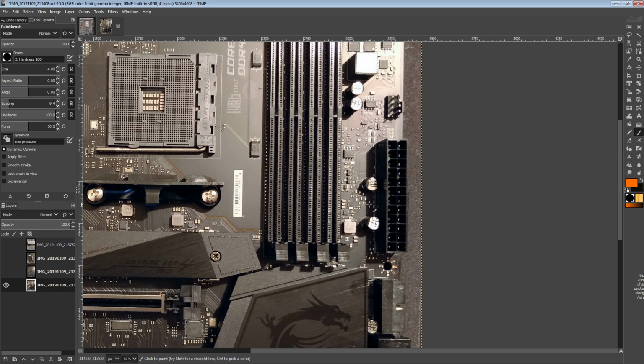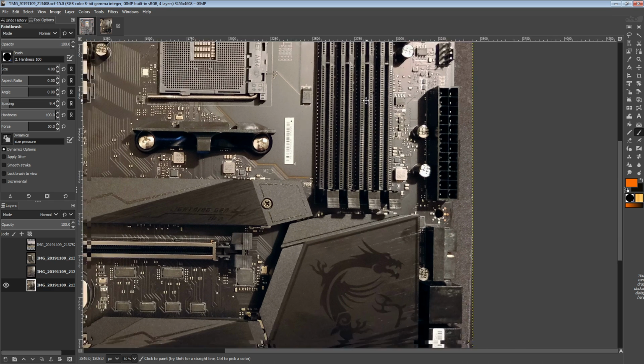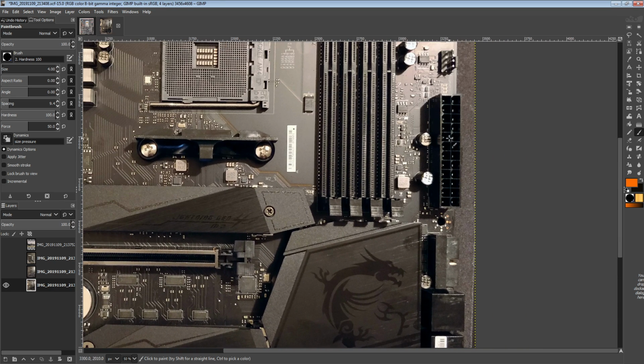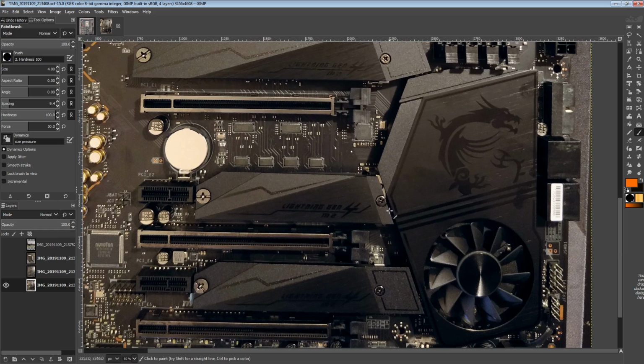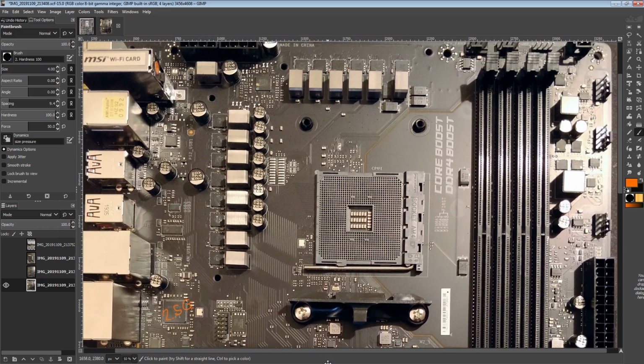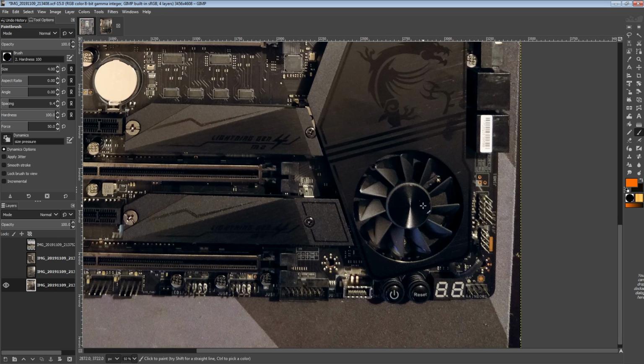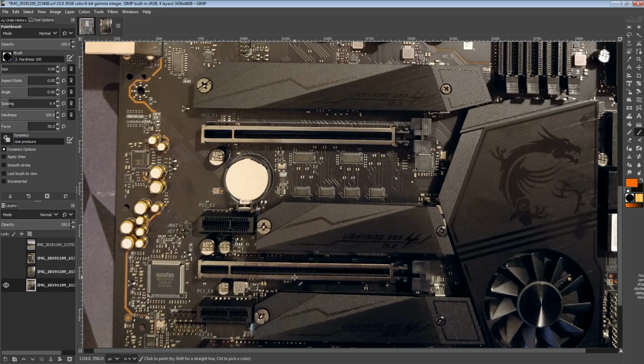Well, MSI's variant of the 24 pin definitely isn't capable of handling more than 8.5 amps, because MSI does not use the high current version of the power connectors for their boards. Yeah, so it's going to melt the 24 pin, and, well, you're going to have a bad day. However, normally the way high-end motherboards get around this is you have like a Molex connector, which I hate, or a 6-pin connector, which I think is good, to provide extra power to your PCIe slots.